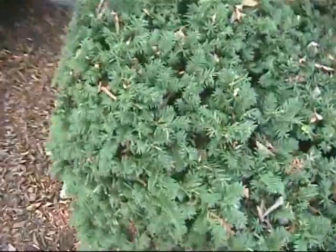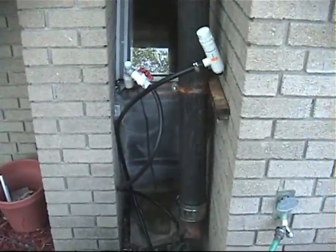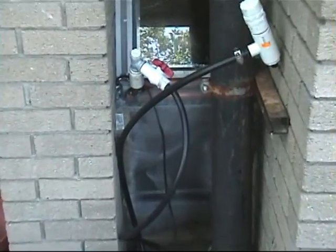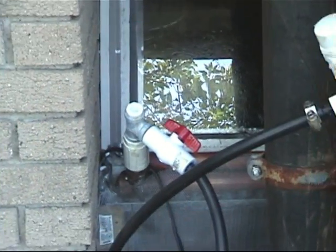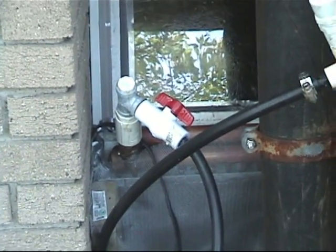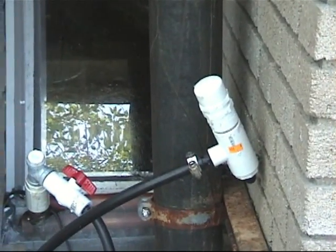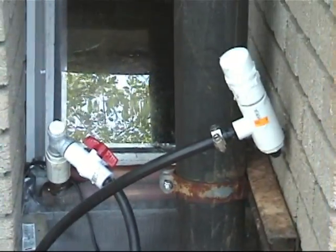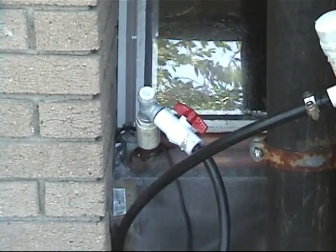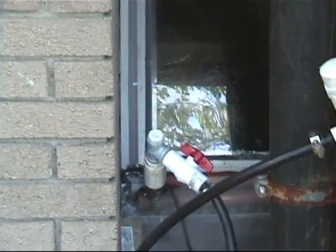Now here are some of the regular coils. It's covered with a screen to protect it. It has an on-off valve, and part of that is so we can have a port to blow air through it. Another port — you take that cap off — we can put antifreeze in there. With the smaller port unplugged, when it starts running out the lower port, we know it's full of antifreeze. You do this after it's blown out the air. That's a typical coil.